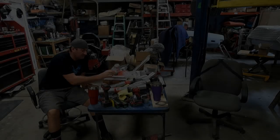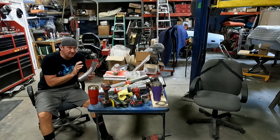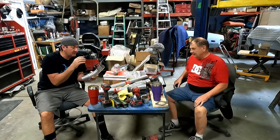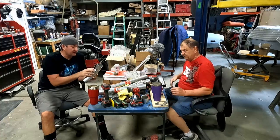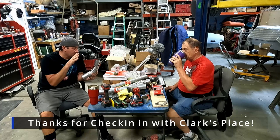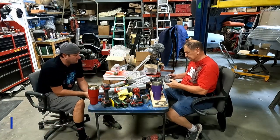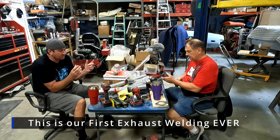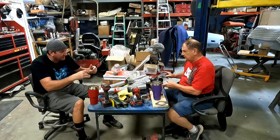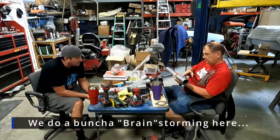What I'm saying is this bend, I don't want to use this to make the 45 or to make a 90, because it's got all this bendy stuff. Any weld job that I've seen where they make a custom exhaust, you don't use bent pipe like that. You cut straight pipe and make pies until you step it however you want to make whatever turn.